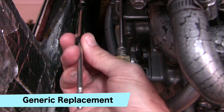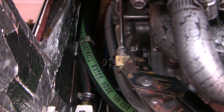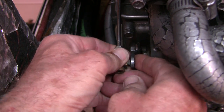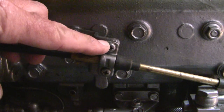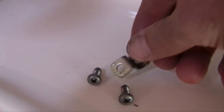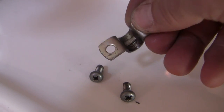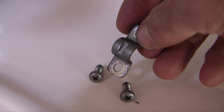I've threaded in the new cable — it appears to be the correct length and it seems right on both ends. Now I'm going to take off this little cotter pin there. This slides out — don't lose the washer. Let's undo these two Phillips head screws so we can get more latitude. When you think about how a cable works, the outer shell has to remain stationary while the inner core moves, and to hold the outer shell stationary there's a little rib that dovetails with the edge so the outer cable can't move.